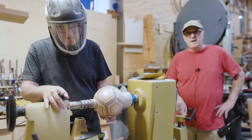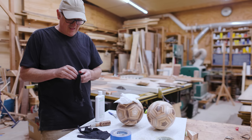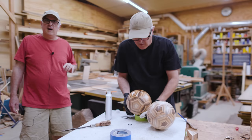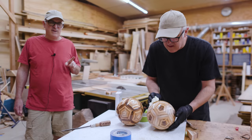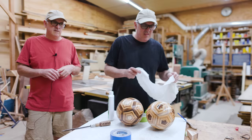I think I'm just going to do a regular finish. I've got some YouTube standard-issue black gloves for the finish. I got a new bottle of tung oil, so I'm going to try that. You're supposed to put it on fairly thick — it's kind of hard doing a sphere because you have to hold it while putting finish on. This is where having a big bucket of oil would be nice — you'd just plunge the whole thing in and pull it out. But I have to make do: put on fairly thick, let it sit for an hour, then wipe off the extra. Hopefully it gives a nice, simple, clear finish.